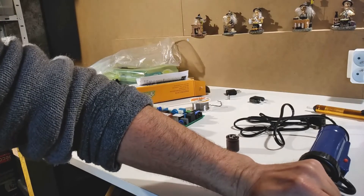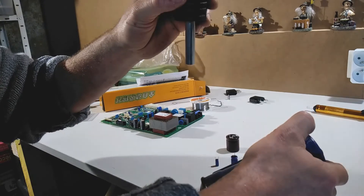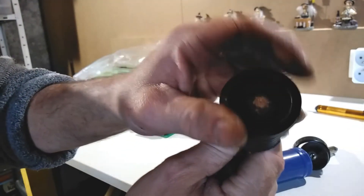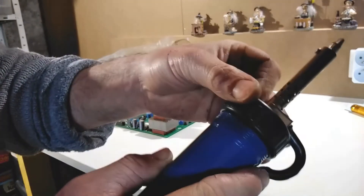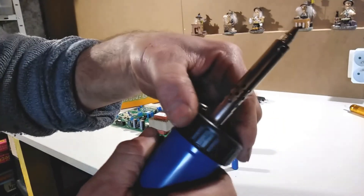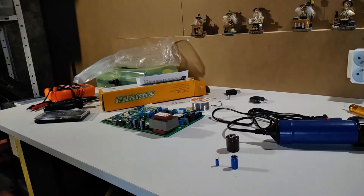I reckon it's cool enough to open up and see what's what. On this part it's collected a little bit of solder on the rubber end — it was black before, but that can be removed. So to summarize: it gets hot, it melts solder, you press a button, it activates a little electromagnet that pulls on a suction cup, creates a vacuum, and sucks the solder into itself. That's how it functions. I'll let you know how I get on with it — thanks for watching.